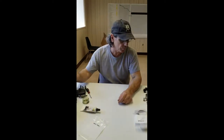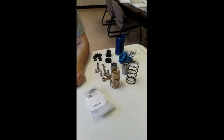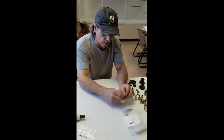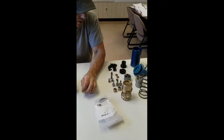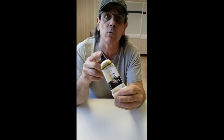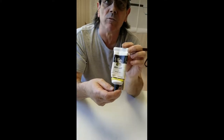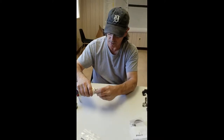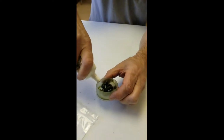I've taken an adapter apart and cleaned all the parts in a cleaning tank with some cleaning solutions. You get a lot of the old grease off. They had the wrong grease on this one — it was causing some of the adapter o-rings to swell up. When I rebuild it, I'm only going to use the grease we recommend for all our adapters: the PST-407 from G-Man. It's got a green tint to it and the consistency of applesauce.